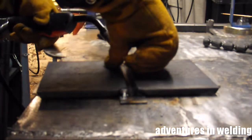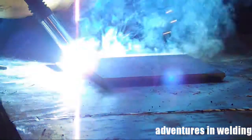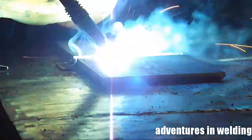Finishing tacking up a plate here — this would be a 3/8 plate, 70-degree V-groove with backing. Here we go. You want to use a push technique with spray transfer; I've done it with a drag also, but they say you want to push. And I'm oscillating it just a little bit to spread the puddle out. Here's a close-up look — as long as you're getting that good hissing sound, you're spraying just fine.